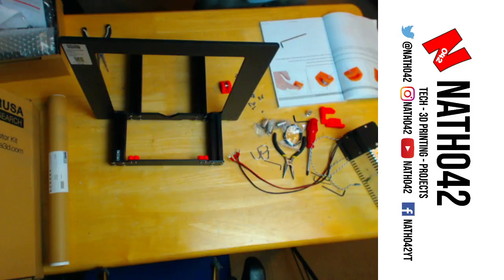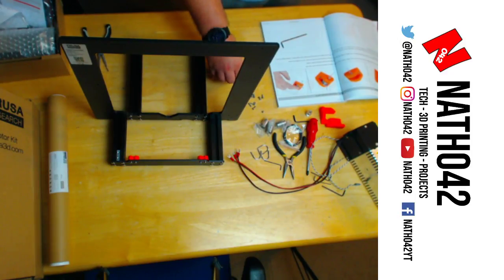Oh damn. Oh, as it says, in case you can't press the nuts in, don't use excessive force. Take the M3 screw, thread it from the opposite side of the printed part. As you tighten the screw, it'll pull the nut in. You know what? That is a great idea. I'm going to do that quickly now for these other ones, just to pull them through.